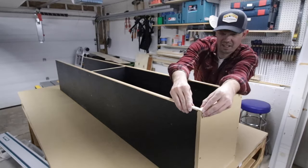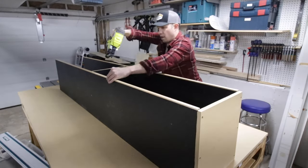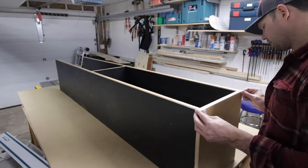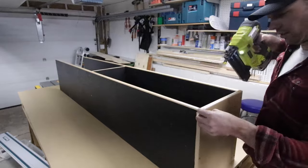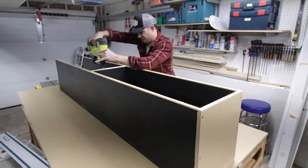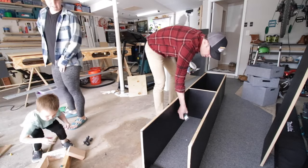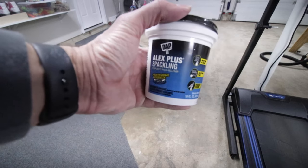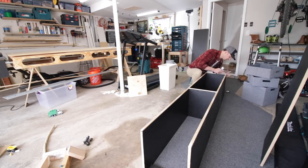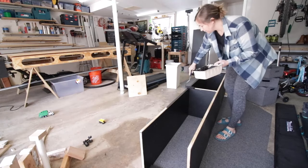The last step for the boxes was to install screen molding on the faces. It's readily available at the big box store — it's made of pine — and I used three-quarter inch nails to tack it onto the front for a nice finished look. The little bottom hangs over the carpet just a little in the closet, which works great. After that I filled all the holes with DAP Alex Plus Spackling, let it dry, and my awesome wife painted the boxes while I went to work assembling the next shelf box.